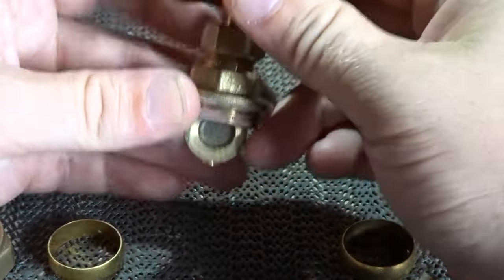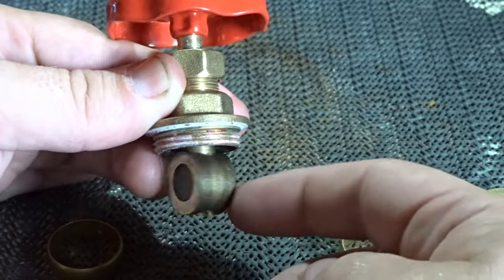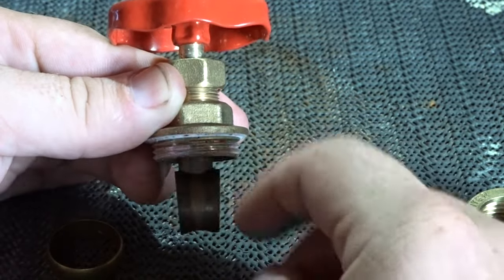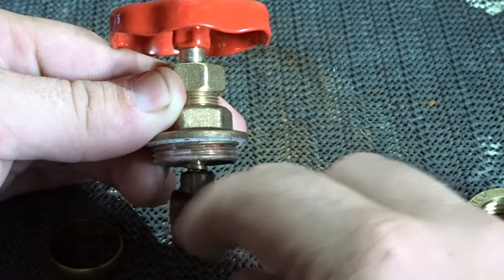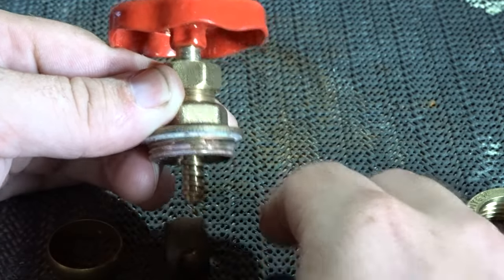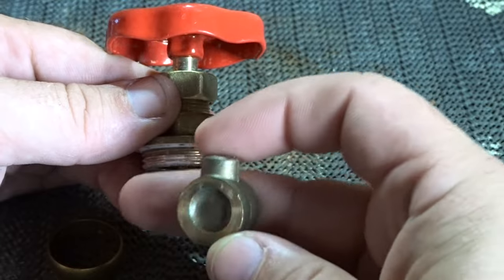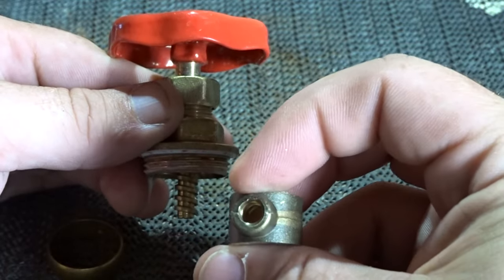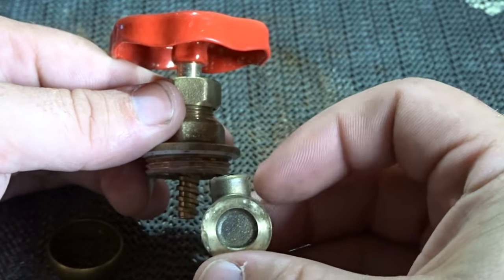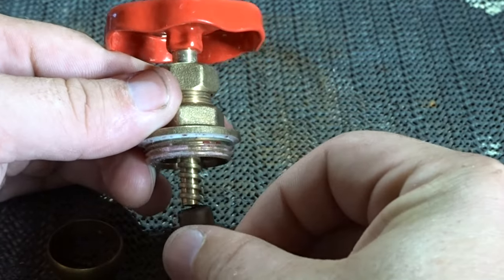This is our gate itself. Unwind the gate — this section can be removed from the spindle by turning it in an anti-clockwise direction. So that is our gate removed. These can be removed and a new one can be put on if there is a fault or if water is passing.